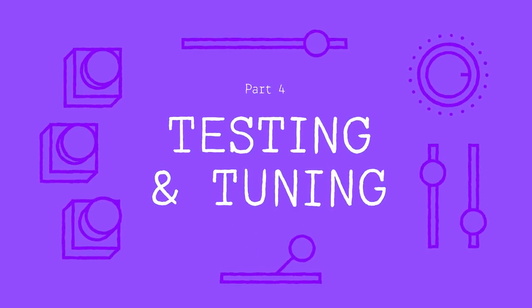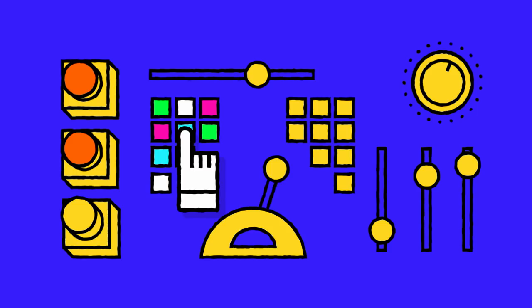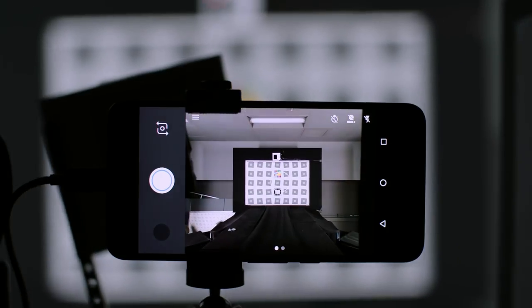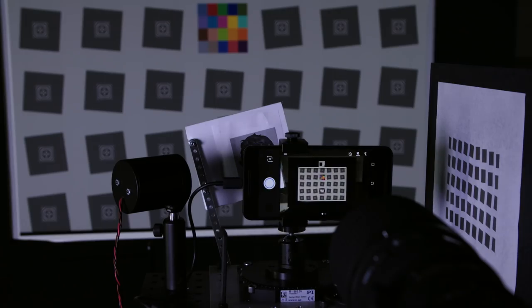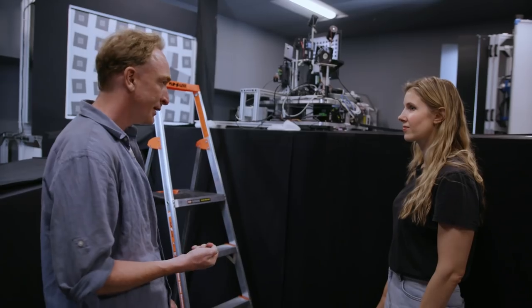Before making this episode, I didn't realize the extent to which cameras and phones have been tested and tuned. There's a saying in engineering: if you haven't really tested it, it's broken. A lot of camera quality really depends on how you create the set of tests that allow you to know how well you're doing. Tuning a camera is a mix of art and physics with thousands of parameters to adjust, and the problem is they all interfere with each other. You make one change and you have to figure out the ten other things it also affected. There are labs that run the camera through a gauntlet of automated tests, measuring autofocus, white balance, overall color and tone, resolution, and more. Without this kind of testing, it would be weeks and weeks just to get one data set, and you couldn't iterate the way we do in engineering.